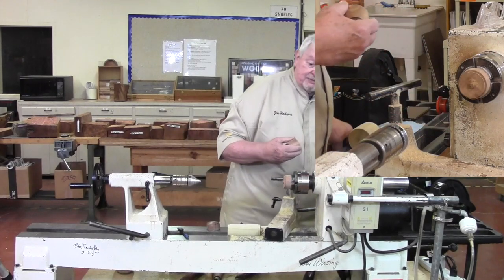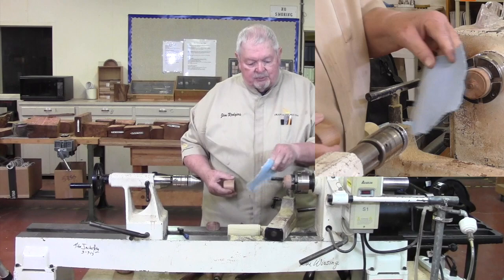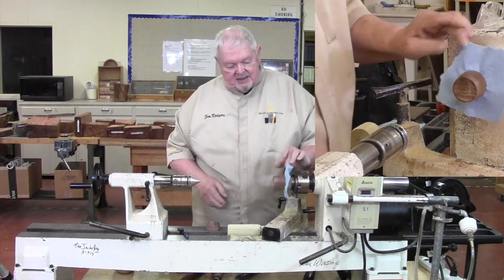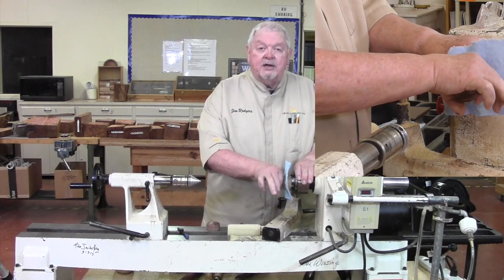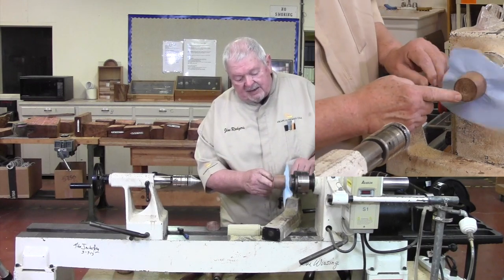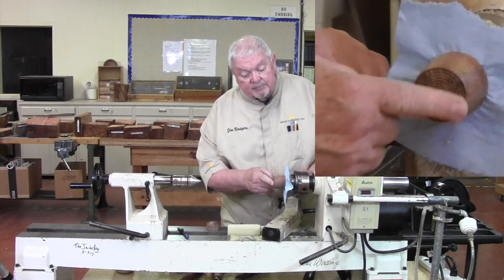There are solutions. There's nothing wrong with the jam chuck adapter I have here. That's all nice and snug. I undercut it by a fraction. A piece of dry paper towel allowed me to get back in here and complete this base.